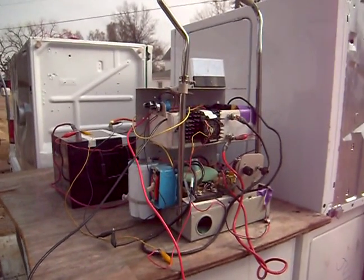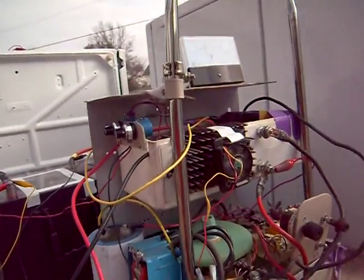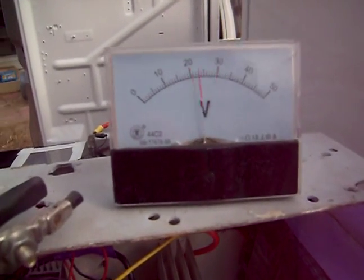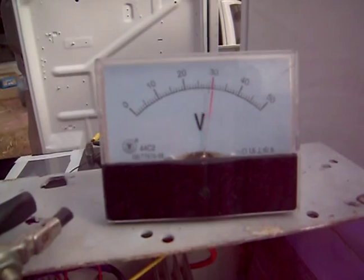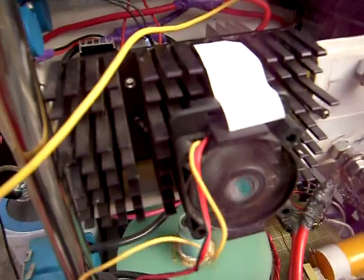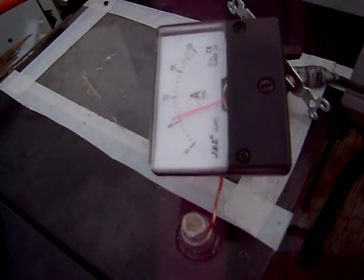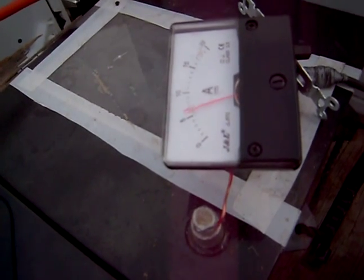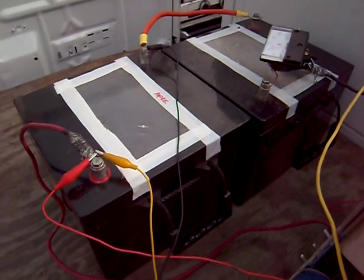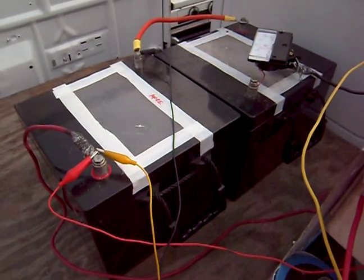The goal here is to form the plates and then pulse charge, which you can see — this is pulse charging right now and it's going from 20, 18 to 30s and all I've got is a 5 amp input. Can you see that? 5 amps, maybe a little more, as these 100 amp hour batteries will go down.